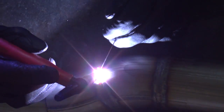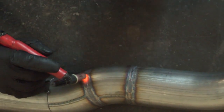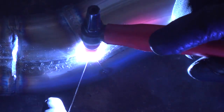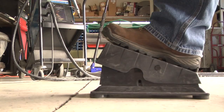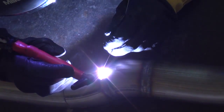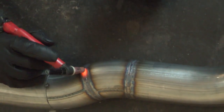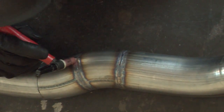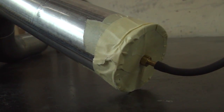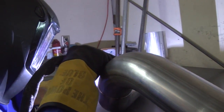I just finished welding the 409 stainless tubing — it's about 14 gauge thickness. I welded it at about 65 amps because that's the right temperature where it begins to melt but doesn't blow holes, especially if you have a little gap between the two pieces. What I like to do is pulse the pedal: you put in a drop of stainless rod, let off so it cools, then do the next drop. This keeps it from making a big hole or burning through. Once the metal is tight again, I can keep going with the pulsing and it lets the metal melt into itself. We back purged it to get a nice clean inside weld without any of that crystallization you get when you don't purge.